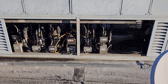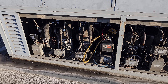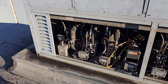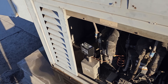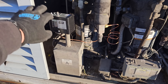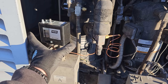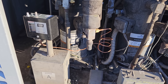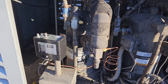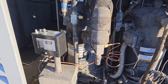About four days ago it was pouring rain — actually snowing here too — and I got a service call on the walk-in cooler, this first compressor. What had happened was the capillary rubbed out for the low pressure side of a dual pressure control and it dumped the charge. I'll throw up a little clip of some stuff I shot real quick.